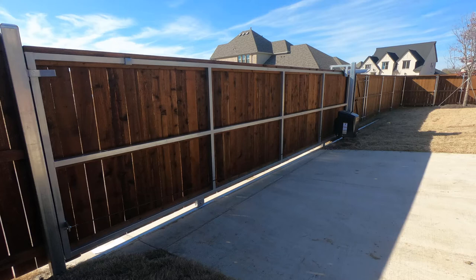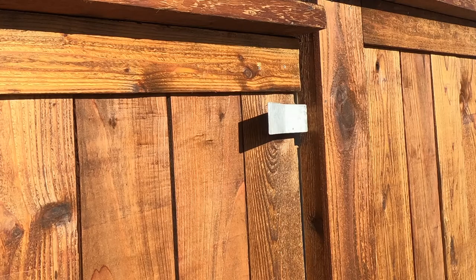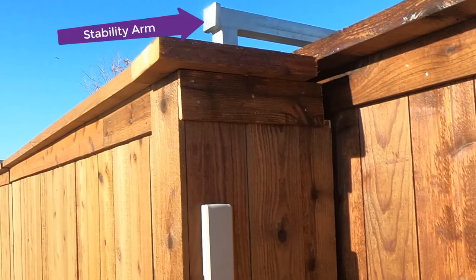Okay, so let's talk about that v-track. It's attached to the concrete, but in the yard they dig footings and pour concrete, so it's supported on concrete footings in that yard. And look at the size of those wheels — remember that frame is 2x2. Those wheels are steel, just like a railroad. They're massive. In this shot you can see that stability arm and the rollers on either side that hold that gate upright and let it go back and forth. You can see that 4x4 steel post — we even cap it to keep the water out. It's the little things that matter. There's the solar panel, and you can see that track in the yard with the concrete footing underneath it. Here is the catcher from the outside, and in this shot the stability arm up top and the keypad.